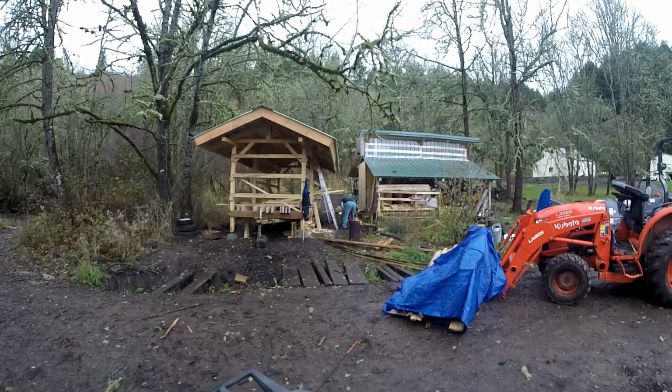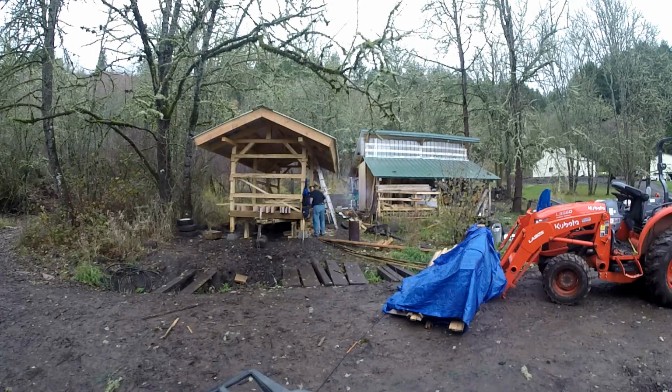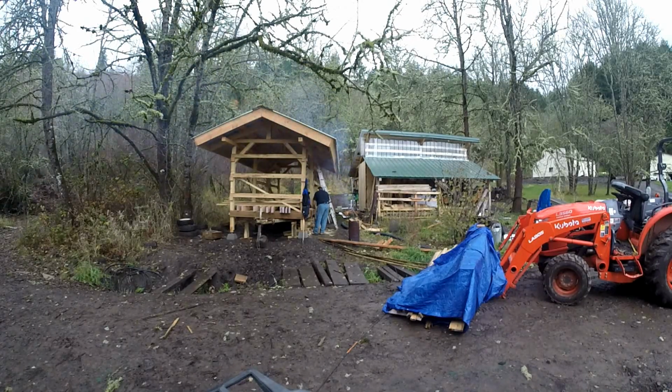I was also able to use the table saw to clean all of the stickers up and bring them down a little bit in size. They were all rough cut at about 1 1/8 inch and a quarter, so they were all just a tiny bit different size. And since they were cut green, obviously, and they're only 1 inch thick, they tend to twist and warp just a little bit. So using the table saw, I was able to clean them up and bring them down to 3/4 of an inch, so they're all the exact same size, and those stickers dry actually pretty quick, surprisingly.